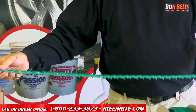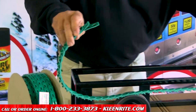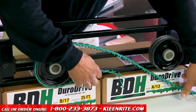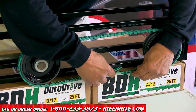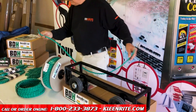We're going to take a length of belt and you can fit it to the pulley. It goes around — flip this. And when you have the right size, it's going to be a little short. You want to make it about an inch short, or one link length for every two feet.